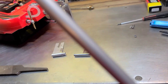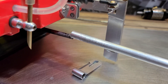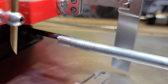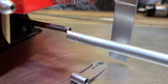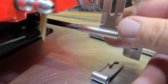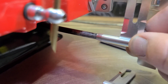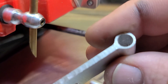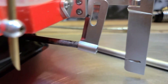That's going to slide right onto our stuffing tube. I drilled the hole one size smaller than my stuffing tube so I can file the inside out and get a nice tight fit, so we don't have to Loctite it in place. When we're done it's going to look something like this. This strut without modification would be ideal for this boat, but it's a four millimeter shaft and I don't want to run four millimeter. The other one is a 0.150 shaft that I don't have a bushing for, so we're going to make our own.